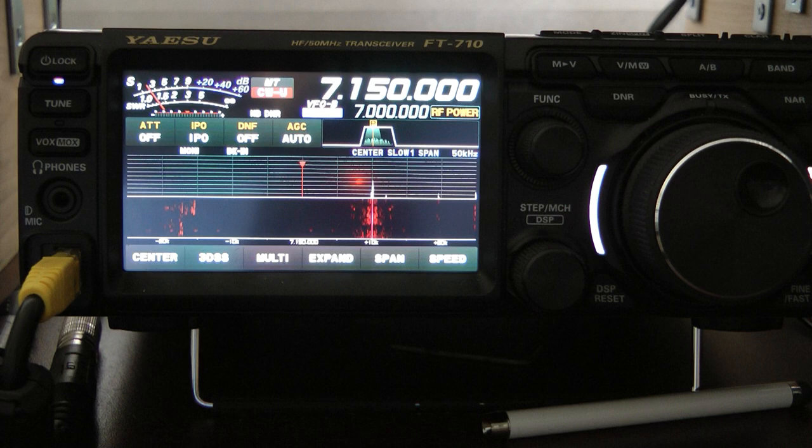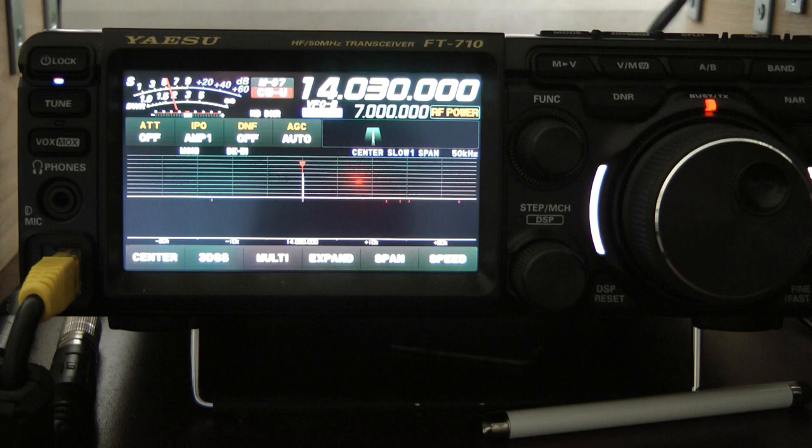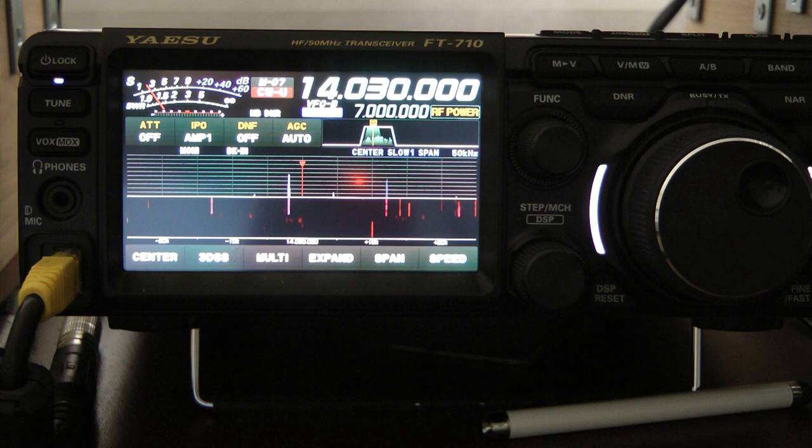And right now I've got the radio set on 20 watts and I'm going to key up. Look at that. The meter is just barely moving. I didn't even bother to put an analyzer on it. The SWR is really good, and the great thing is, let's go over to 20 meters, and yeah, the SWR is a little higher there. It's a little below 2:1. The great thing is with this antenna, I can roll up a little bit of wire and tweak my SWR for whatever band I am working. And that makes it really nice.